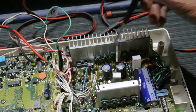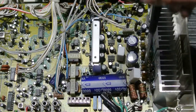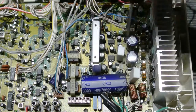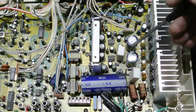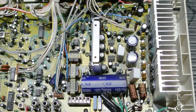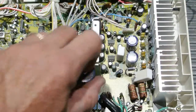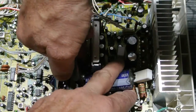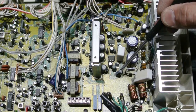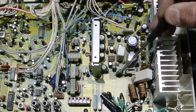Underneath the plate this area is primarily the power supply section of the main board. Here we're looking at the same power supply section that we saw in the other shot. You have a variety of electrolytic capacitors that make up a large portion of the power supply. Even though it's a little hard to see behind this really big 6800 microfarad cap right here, I'm going to move that out of the way because it's going to get replaced anyway — no harm in just clipping it out for right now.